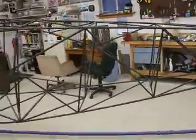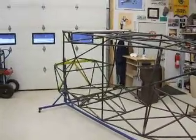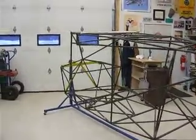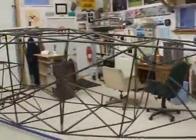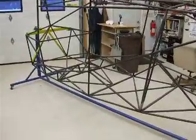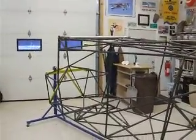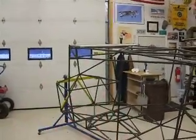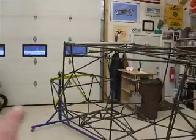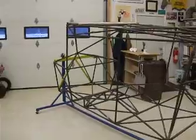What I'm talking about now is trying to weld on the fuselage. The problem with this particular setup is that although the rotisserie's imaginary line goes from front to rear through the middle of the fuselage, the bottom of the fuselage has a lot more structure on it than the top does. So when I try to rotate it in the rotisserie, the fuselage tended to come back to rest where it is right now because of the weight differential.